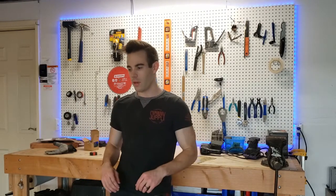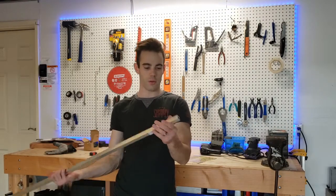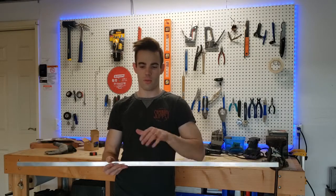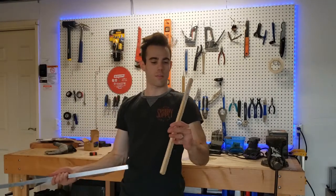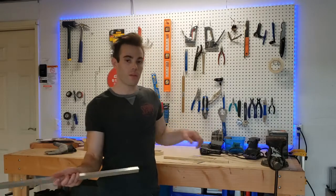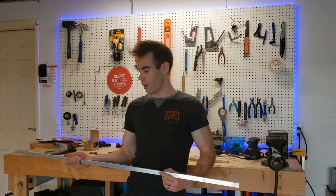It's kind of interesting — what we're going to be doing is using these guys here. They're four feet wide, three-quarter inch square by one-sixteenth inch thick aluminum tubes, and we're going to be using these as cross members to support the platform. Down here are some dowels that just happen to fit fairly snugly inside of these, because I don't have a welder and I wanted you guys to be able to do the same sort of thing at home just as easily and cheaply.